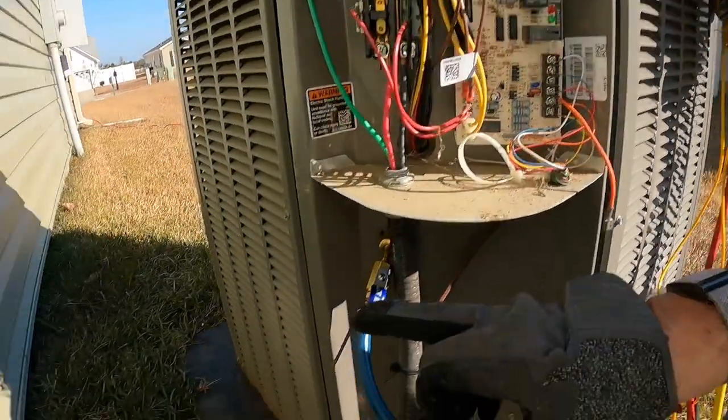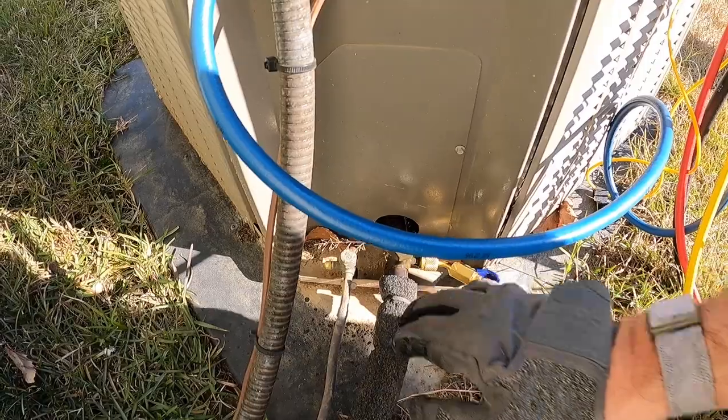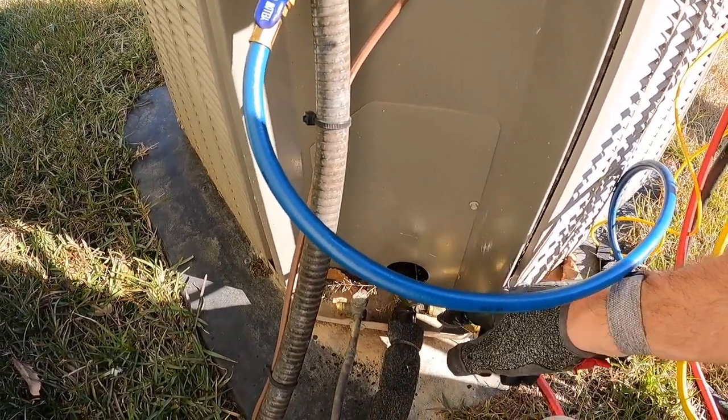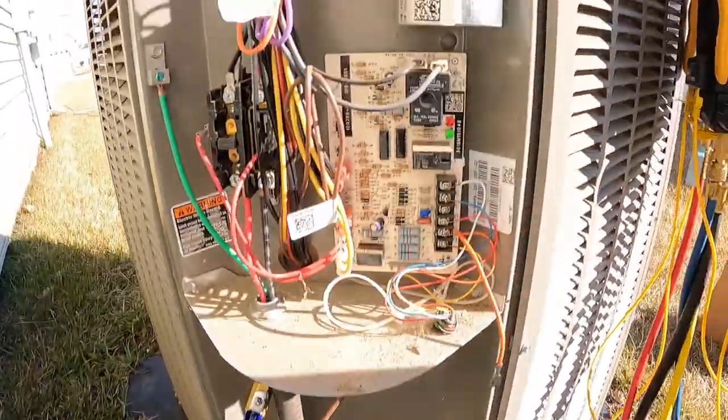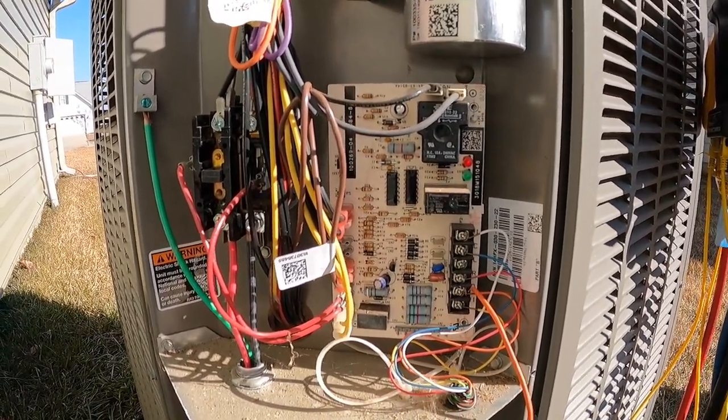Almost forgot, I gotta show you how to diagnose this issue. So what I've done, I've got my low side hose hooked up to my true suction port, high side on the actual suction port. Can't remember on Lennox whether we're gonna read high here or there. Basically, if you have it hooked up and it's reading low, just put it on the other one. And then I've got a jumper set up for O, so I can touch it to R. If the pressure starts getting too high or too low, we can pop it into cool mode. Pretty sure that this unit operated fine in cool mode, but it starts starving the condenser coil in heat mode and pushes way too much pressure into the evap coil. So hopefully that's what this does again, so I can give you a look at what that looks like.